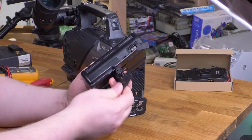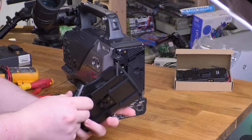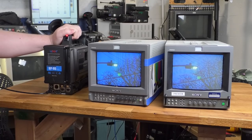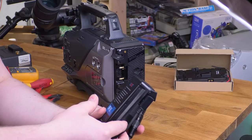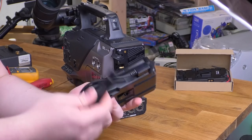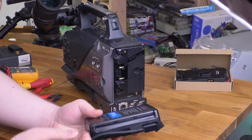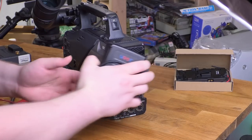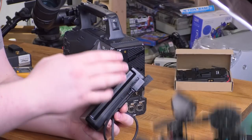What you plug into D-Tap is a whole great variety of adapter cables. I've got one right here — this adapts from D-Tap out to a 4-pin XLR. So I can just plug this in, and if I have something that doesn't have a normal battery input, I could plug this in. To illustrate how cool that is: I've got two 8-inch Sony PVMs — one takes a V-Mount, one doesn't, it just takes the 4-pin XLR. I could run both those TVs off this one battery. And they make larger capacity ones, so I could probably run those TVs for several hours off just one battery. That beats anything in the entire consumer market — there's nothing that cool that you can buy as a normal individual. In the video world, you can hang this on the back of your camera and have a D-Tap fan off through a hub to power your audio recorder, your video light, and your wireless transmitter all off of one battery pack.